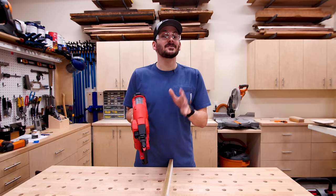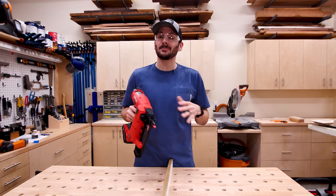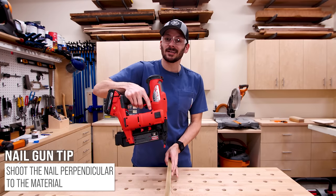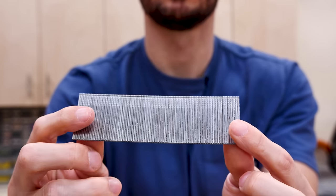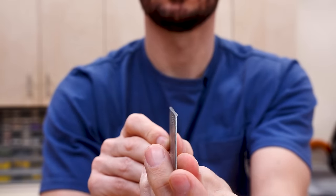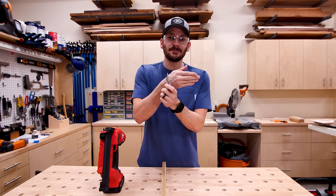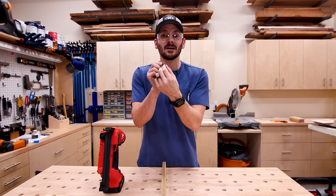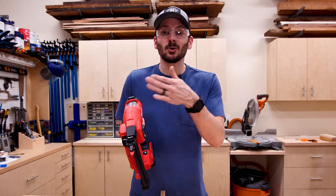Keeping the nailer vertical and going towards the center is definitely going to help. But here's the tip that has reduced blowouts on my projects almost down to none: don't shoot in line with the board — shoot the nail perpendicular to the board. The nails are kind of like a two-by-four in that they have a wide face and a narrower width, so the nail wants to bend left and right as you shoot, looking down the barrel, because it does not want to go up or back. If we know the nail will go left and right, turn the board so that left and right is safe and won't blow out. Coming right up to the edge with the nailer perpendicular — it did not go anywhere, even closer than the last one that blew out. Keep your nailer perpendicular to the board you're nailing into and it will drastically reduce blowouts.